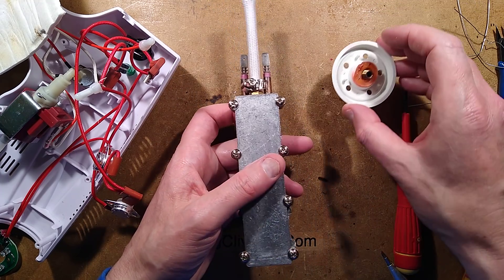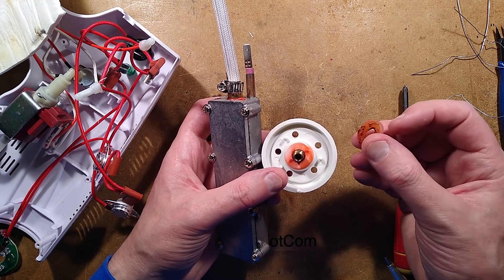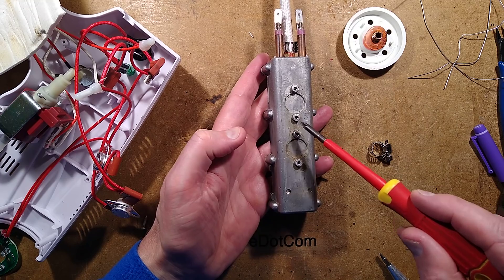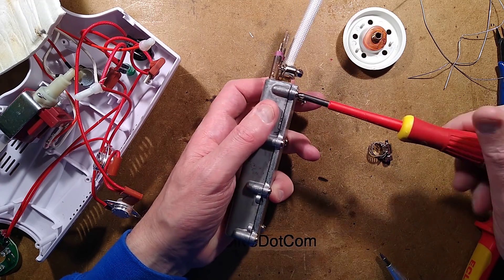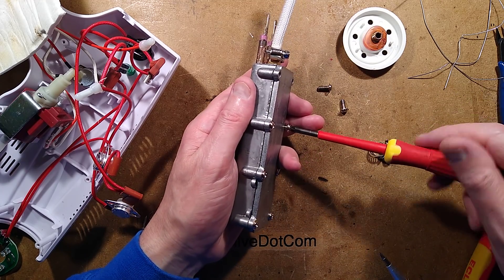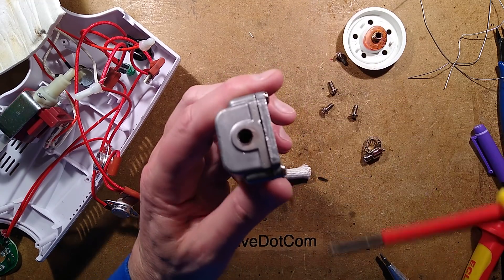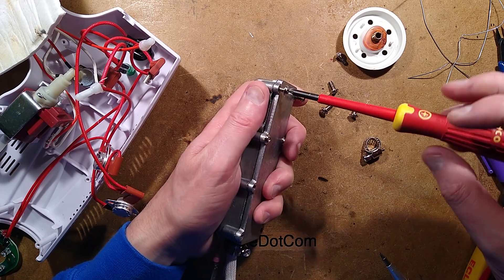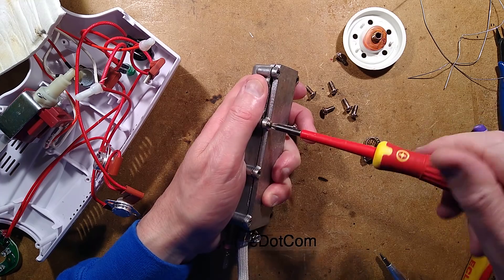The inlet port is glued in and sealed with RTV — room temperature vulcanising silicone — and likewise the one at the other end. It's got a strange, standard clear silicone washer that's kind of all stained. Let's open this up. I really like the fact that it has the pillars for the thermal switches; it's very nicely made. Worst case scenario is the lid may be glued on, but I can actually see it lifting up already. So far so good. I can tell from looking down the end there that it doesn't look like a standard smoke machine, which normally has a copper tube spiralled round the heating element and then all potted in aluminium. It looks different — and if it's what I think it is, it might be worth every penny of this unit alone.